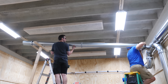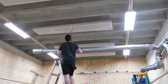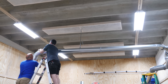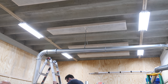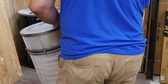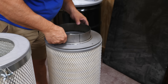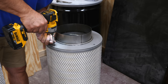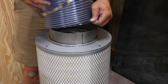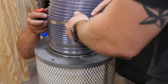The last section to mount was the branch originally planned for the table saw, but I decided to make it a branch for the miter saw and router table insert instead, since the drop was just really in the way at the table saw. With that, all the ductwork was in place. The next step was to get the filter stack assembled — we attached a flange to the upper filter, applying a bead of silicone and then attaching the flange with screws. We then wrestled the flex hose connecting the dust collector to the filter stack onto the flange, which was kind of a pain, but we eventually got it on there.